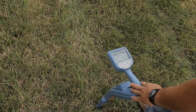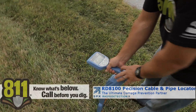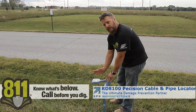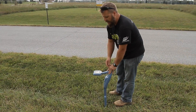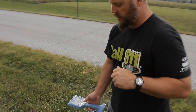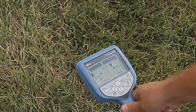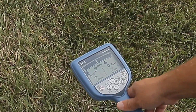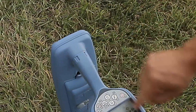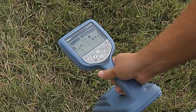Using all antennas simultaneously gives a quick reaction and is a great benefit. You still get your automated depth reading and automated current reading. On the left side you have a compass telling you what direction the line is going. We also have current direction — using four kilohertz current direction, an arrow on the left side of the screen shows current running away from the transmitter as it should. If current bleeds off onto another cable or pipe, the arrow flips, but when you're on the correct line the arrow always points away from the transmitter.